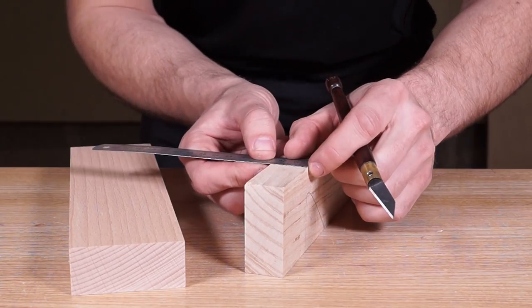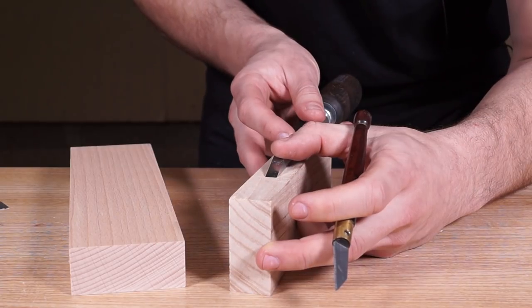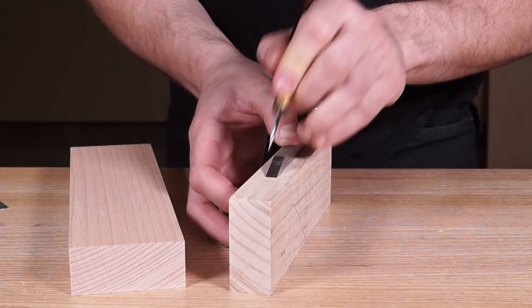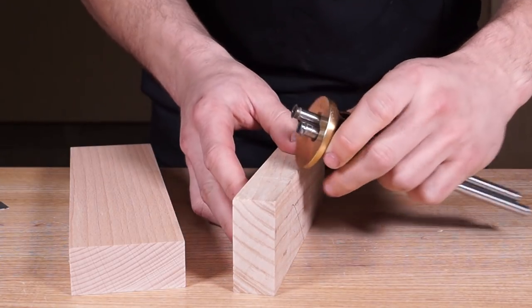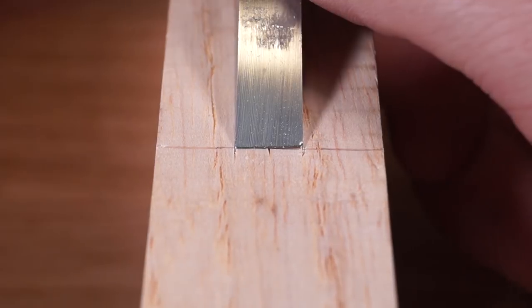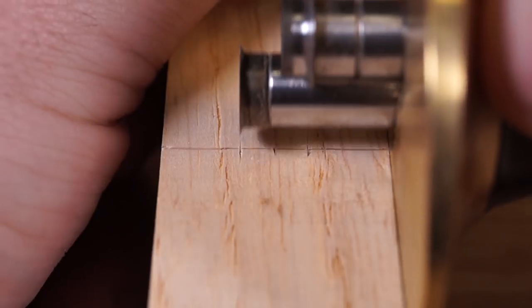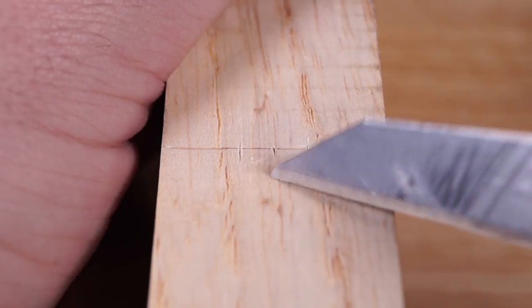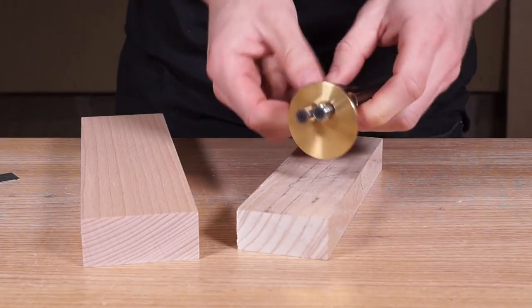Find the halfway point on the shoulder line — 13mm — then lay the mortise chisel down, centralize it on that mark, and put a little mark on each side of the chisel. Then set up the mortise gauge so the two heads are hitting both of those outer marks. Referencing off the face side, one head hits the far point and the other hits the close point. The chamfers on the cutting heads slope into the waist on both sides.